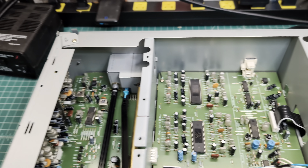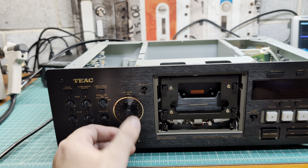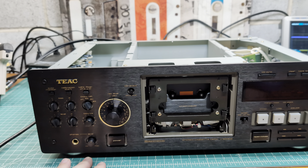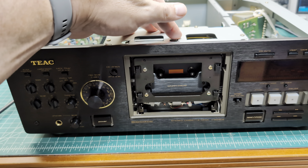Technically it fully replicates the 80-30 model, just with a DC motor — not direct drive. With a good motor and good belts it can play really well, specifically when it was new. But over time these Sankyo tape transports gave me a headache trying to bring them to spec.